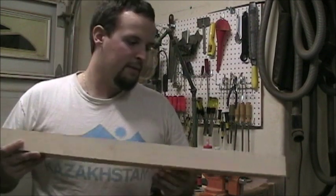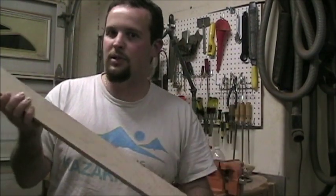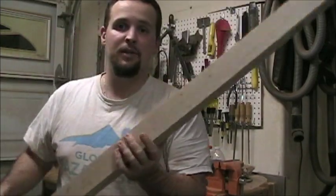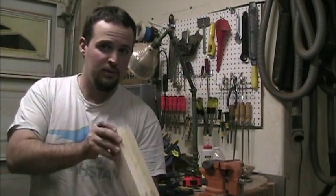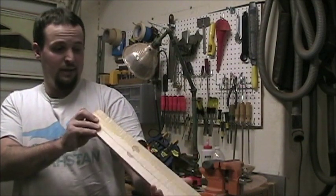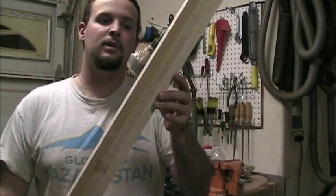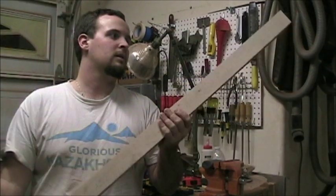I've got a feeling once I run this through the planer you're not going to be able to see those anymore anyway. I think those were just superficial, just kind of on the outside. Another thing you want to do is take the board and kind of sight it to see how straight it is after clamping, and this one looks really really good. This is curly maple, three plies out of one board stacked up and glued together. There aren't veneers or strips in between — that is something you can do as an option, it just makes a little bit more gluing surface.